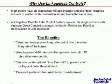A lot of thermal shock can result from that. With these systems we can actually hold the burner in low fire — or pilot hold, depending on the flame safeguard — keeping the burner down in low fire until we maintain some minimum water temperature or minimum pressure before we release to modulation.